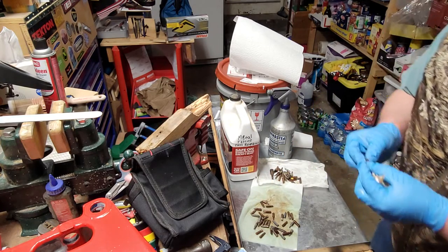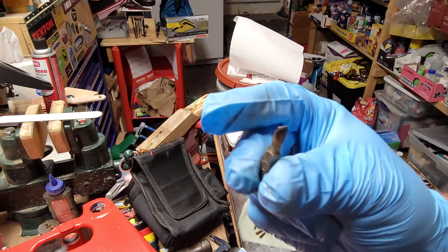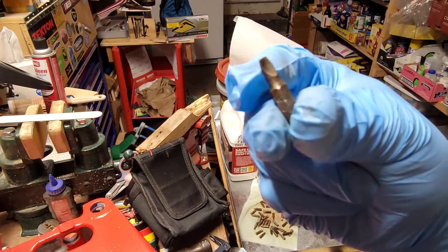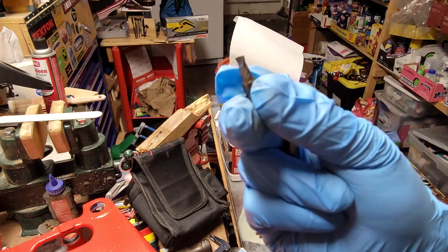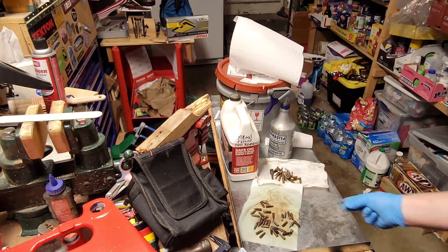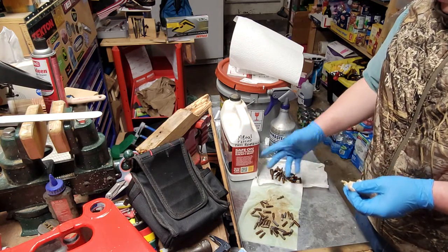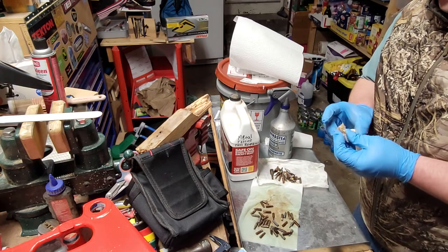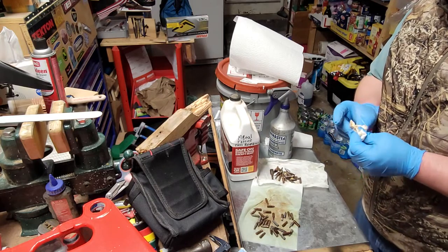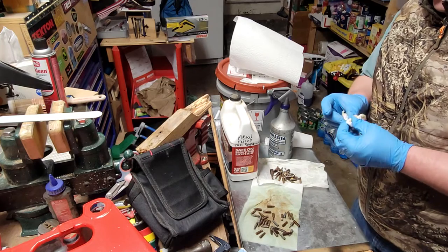Okay, that one's been used. That is known as a flute-style slotted bit, because it isn't a slotted bit anymore. I don't know what that is. That's supposed to be some sort of newfangled drill bit. I'm joking. It was a slotted bit until somebody hit the reverse really, really hard, and the person that heat treated it didn't do it enough. So it's basically annealed.